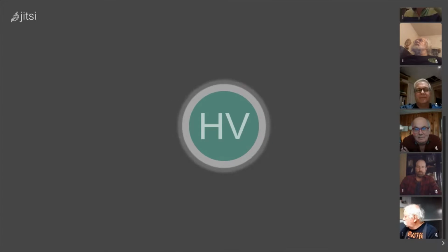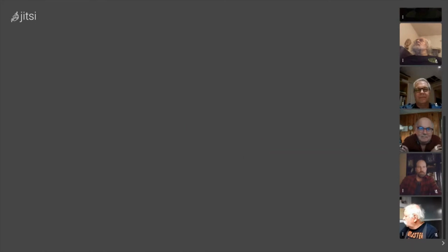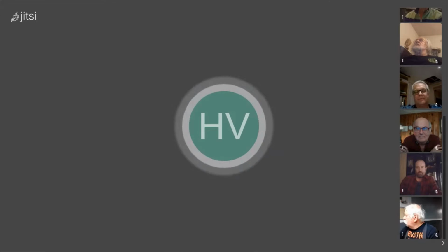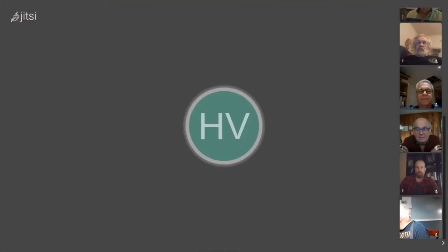The first resistor was perfect. Then I did the other two components, and they were a bit trickier because blobs were everywhere. I think I put too much solder this time. Oh, so that's what solder braid is for. Yeah, I use solder braid to take it off. But if you can apply just the right amount of paste the first time, it's easier. I didn't have a precision instrument. I just used a toothpick or something. But use very fine solder. Yeah, I'm using paste this time. Make it really fine so you don't have big, huge blobs.